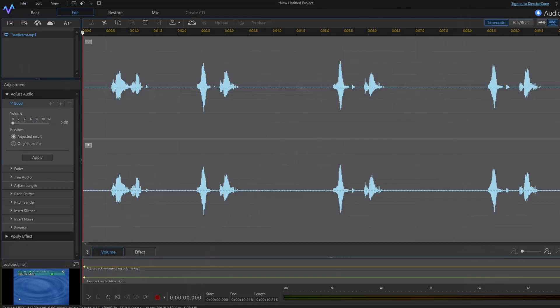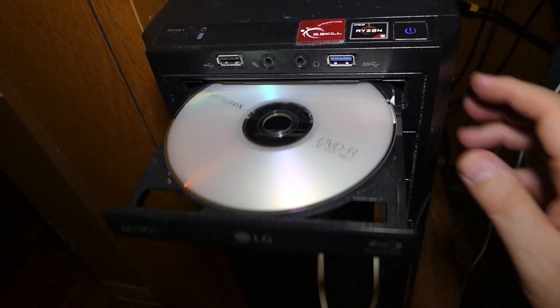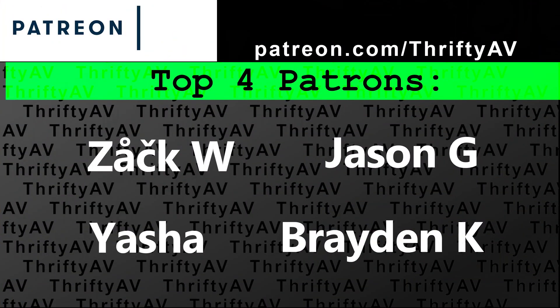In conclusion, when using the S-Video input on the ClearClick VHS to DVD kit, contrast was spot on and colors were pretty good. It lost a little sharpness, but I've yet to test any capture device that didn't. It does mix stereo audio down to mono, so if that's an issue you might want a different device. Direct to DVD had some dropped frames, likely due to my slow external burner — an internal DVD recorder would probably give better results. Stay thrifty everyone!